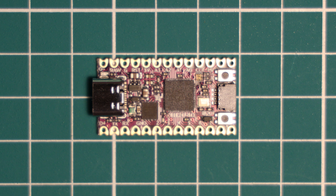Adafruit proposed this board as a keyboard driver, which is the controller that basically runs a keyboard by detecting keystrokes, interpreting them and sorting out the USB device interface. Adafruit says this board, with its 20 GPIO pins available — 18 on the board and two via the Stemma QT connector — is suitable for up to 100 key matrices or common 65% 5x15 layouts. SparkFun on the other hand market this form factor in the form of their ProMicro as a more general purpose board, though of course the KB2040 can be used for many more projects than just a keyboard.